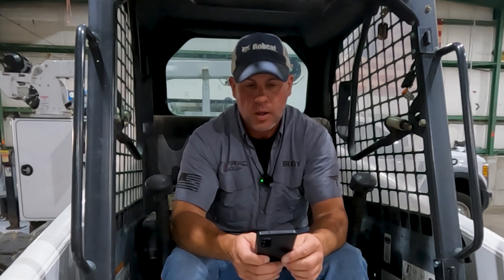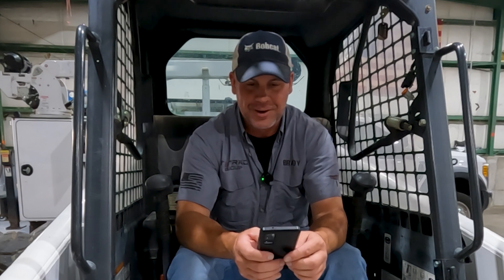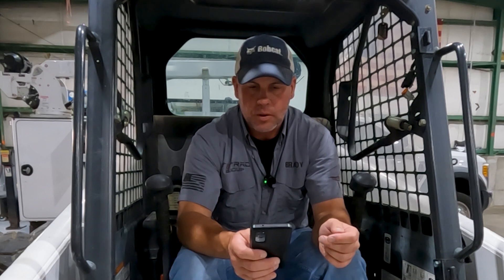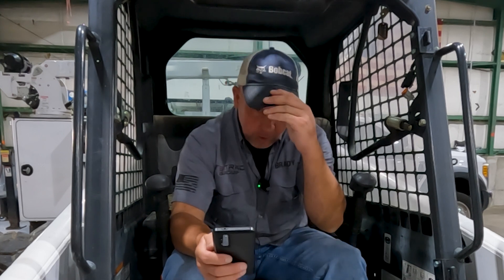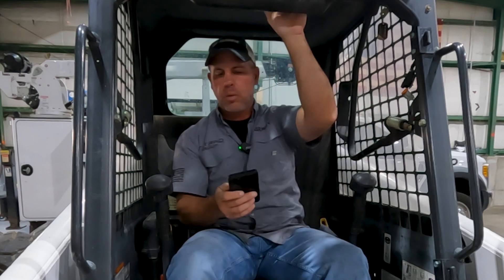This next guy says: 'The sensor on my T750 went out twice. The third time it was in and out. On my 9020B, we pulled the seat bar sensor, took a grinder and ground the contact side smooth, then took out the magnet and zip-tied it — and it's like that to this day.' It sounds like he actually tore the sensor open, pulled out the magnetic part and zip-tied it, so whether the arm bar is up or down it's always going to release. That's kind of dangerous — I don't think that's a good idea.